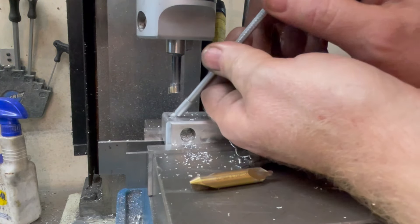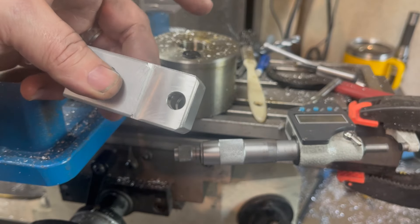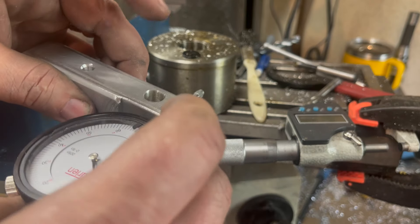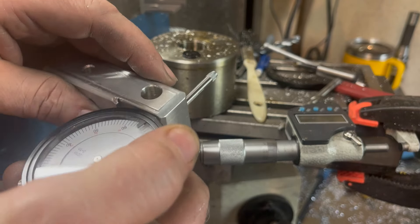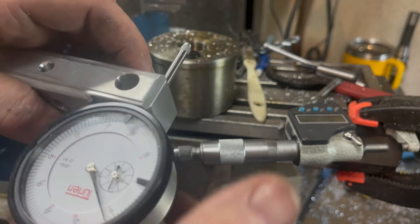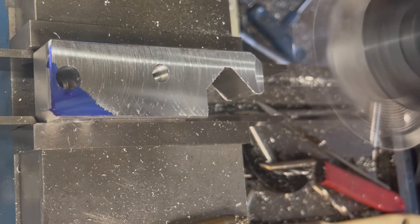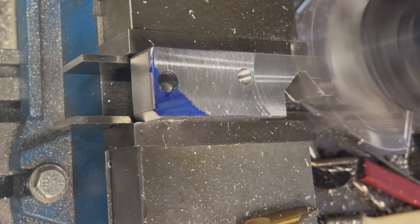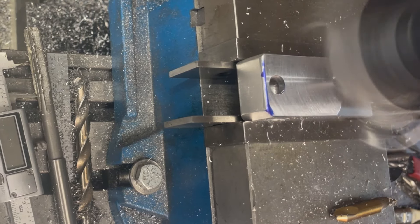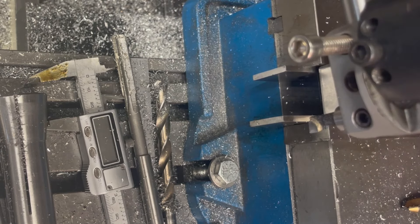Let's take a measurement. The hole was a little undersized — not exactly 375 thousandths — so I'm glad I used the boring bar. It doesn't have to be exactly perfect, but as a machinist using this every day I don't want it to remind me of a failure, and it goes in well enough to stay in place on its own. I already had the boring head in there, so I just put a nice finish over all of it. Now that I'm done with the external features I don't need them as reference points anymore. I stuck an extra boring bar on the opposite side of the boring head for balance at the quite high RPM.